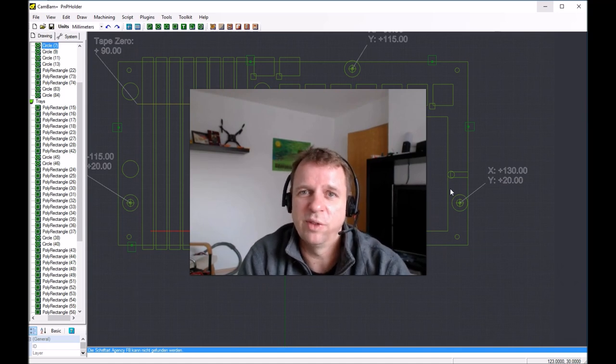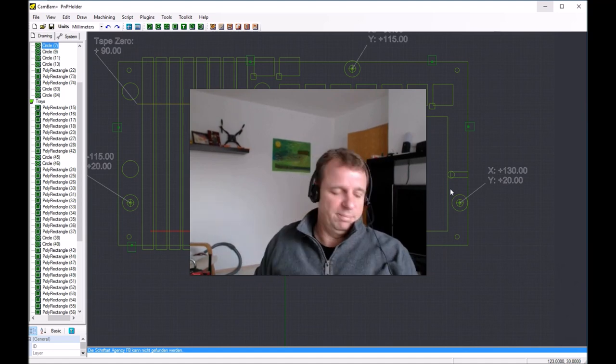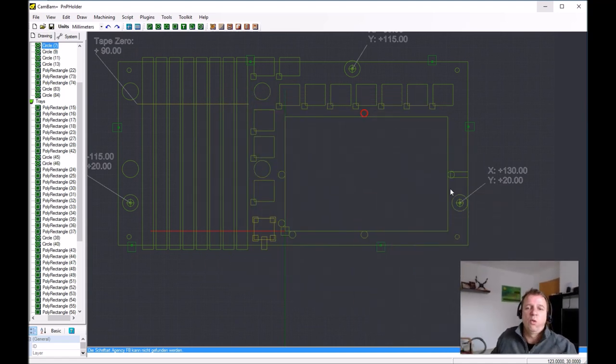The good thing is you mill this yourself, so it's very accurate and parallel to your X-axis. We also have a calibrate block — an idea I had — for the right position of this platform. We also have tunnels: a tunnel for the wire for the auto-probe. You put this wire on a screw, and the screw touches the PCB to make the connection.